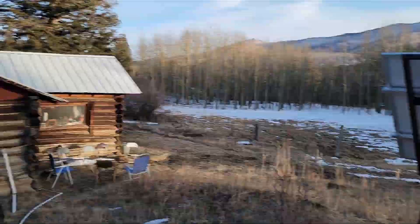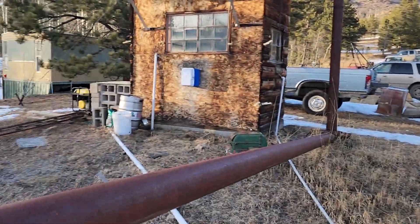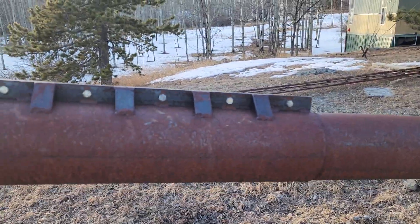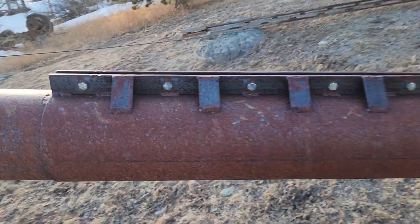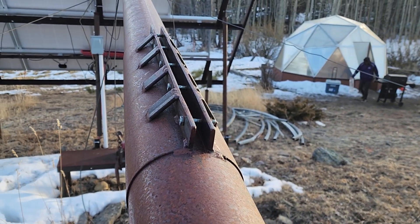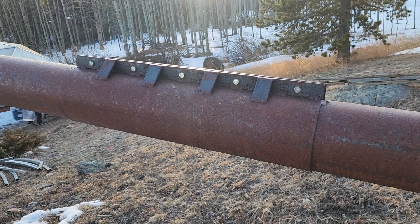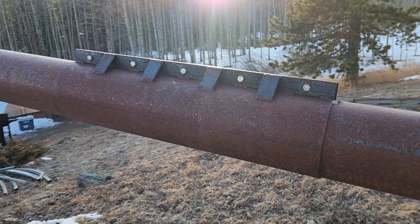So there's four anchors: one at the winch, one on each side, and one on the far side. You can see how we make the couplers — it's just a piece of 6-inch tubing that I split, and welded some bar stock and a bunch of through bolts. This is a good kind of coupler because it makes the coupler actually the strongest part of the tower, where a lot of towers the coupler's the weak spot.